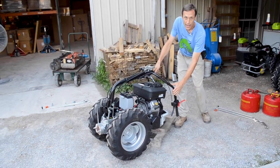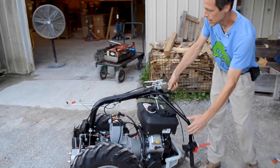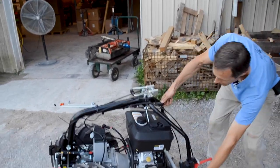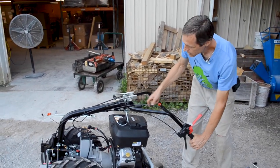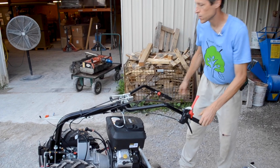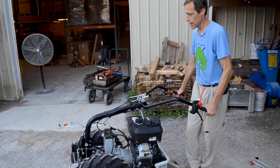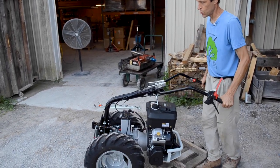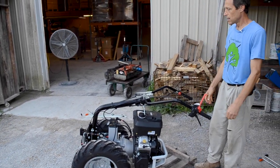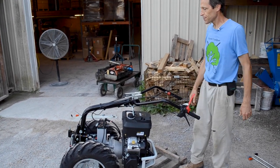There's the handlebar height adjustment control right in the middle here. It's this lever that sticks off the back. Push that down, bring the handlebars up to the desired position, and the lever will lock in. There are about four positions for it, but once you bring those up, you can then roll the tractor around. I've got a little pallet under it just to keep it up off the ground here, but the tractor will roll around when in neutral. So now that you've got it out of the box, because the box is over there now,